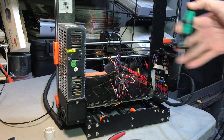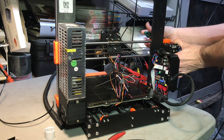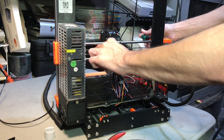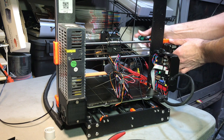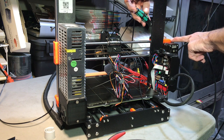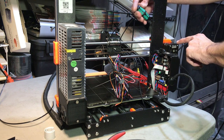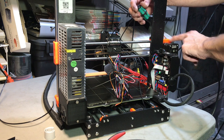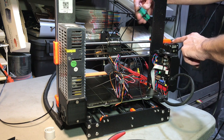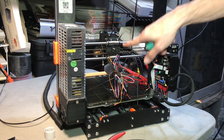When my motor goes sideways there should be some tension on the belt — this one has a little less tension than I'd like, so I'm going to remove one notch from this guy to give that much more tension. Now that we've got some okay tension, go ahead and secure the motor. Once you have good tension, it doesn't need to be too tight or too loose. The tensioning screw just needs to be snugged — its only point is to hold the tension. To adjust and apply more tension you'd need to loosen the rest of the screws first, otherwise it'll gouge into the threads. Belt tension is good and our belt is installed.